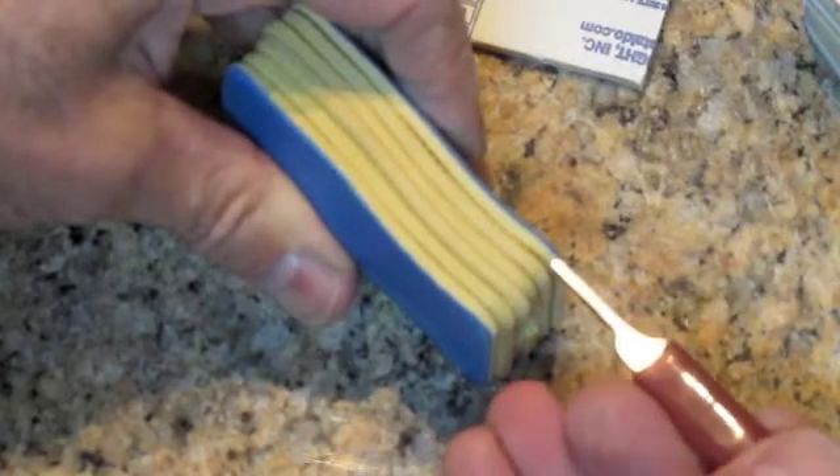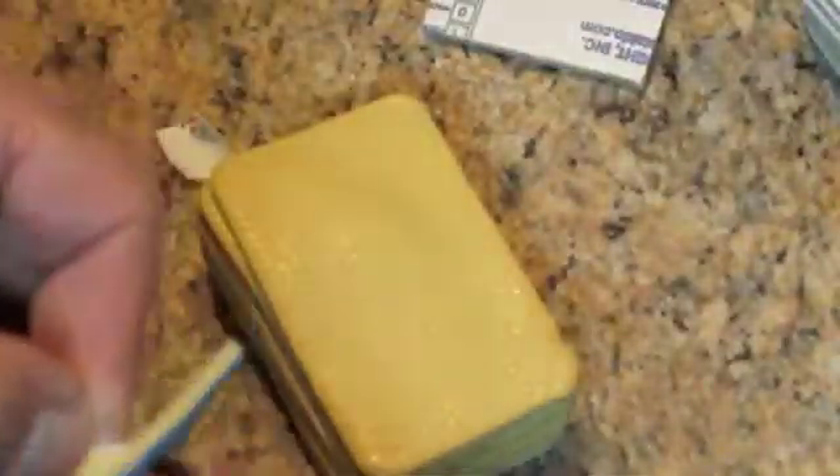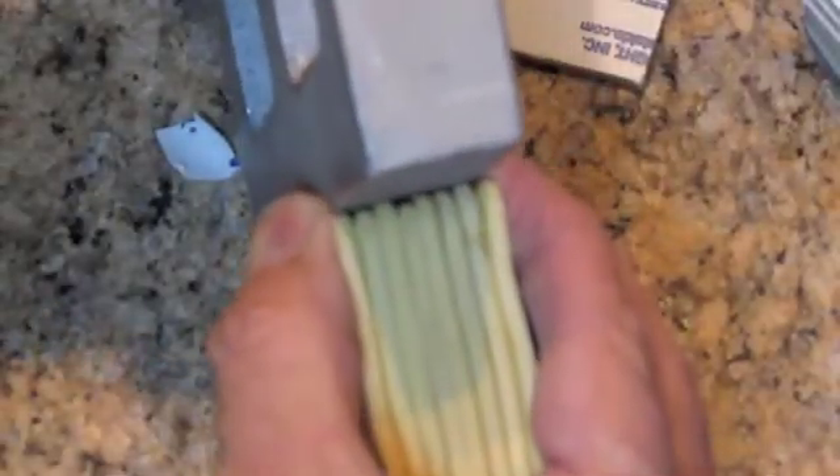Here's six layers of rubber. We're making an eight-layer mold so I'm going to add two more layers of rubber. You'll notice the outside layer — this time I'm leaving the white paper on the outside and taking the soft plastic off. The white paper won't stick to the platens of the vulcanizer, so it'll make it much easier to get your mold out after vulcanization. You can see the sprue sticking out at the end, and now I'll push a brass sprue former onto that sprue to maintain that nice cup shape to push the wax nozzle into.